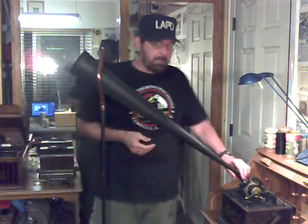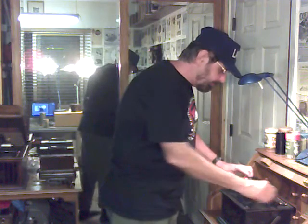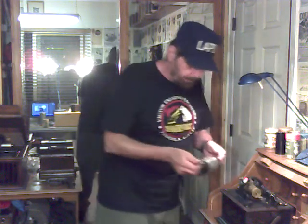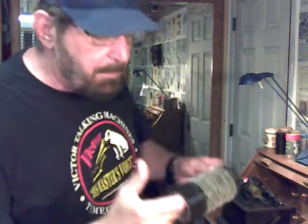As I said, if you were using an Edison recorder, you would have to literally yell into the recording horn — Edison recorders are just not sensitive enough to capture a spoken word in a normal tone of voice. Here is the cylinder, absolutely covered with swarf. The amount of swarf is always indicative of how loud or how deep you have cut the cylinder, and more swarf is almost always indicative of a good recording.